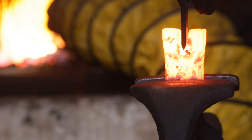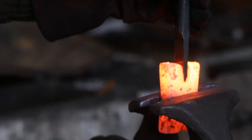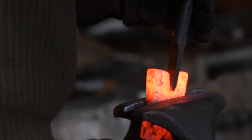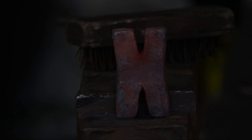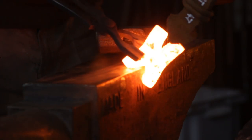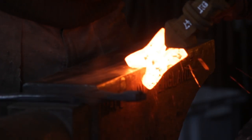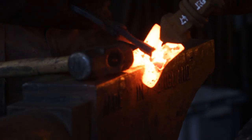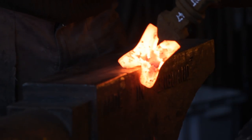Keep an eye out to make sure that you are stopping at the right spot, because you don't want to over-split this. You end up with something that looks a little bit like a chromosome. I'm going to use a big wedgie thing — which is its official name — basically a right angle swage, and I'm going to stick this over a sharp edge of the anvil and carefully open up this cross.